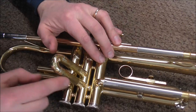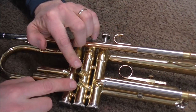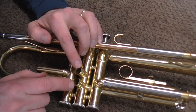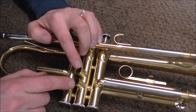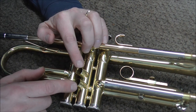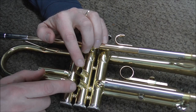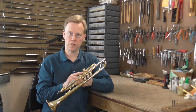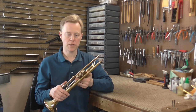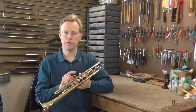Something to watch out for: because this slide sticks out farther, when you push on it too hard, these slide tubes can come off. And if they do, you have to solder them back on and try again. If you do not have the ability to solder these back on, you need to be extra careful, because they do pop off at times. For me, about one out of every five repairs, one of these comes loose. So if you can't solder them back on, be very careful, or you might want to take it to a repair shop. On video it's hard to explain how much force you can use before the tubes come off, and it's different on different trumpets. If you get a junked trumpet that you can practice on first, try it — push as hard as you can until it breaks — then you'll get some feel for how hard you can push before things start to break.